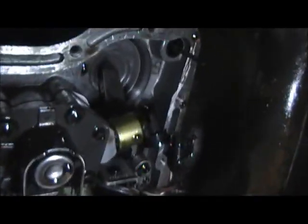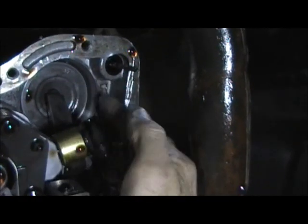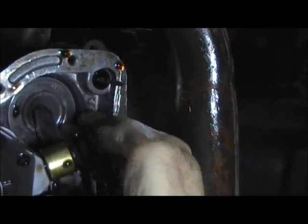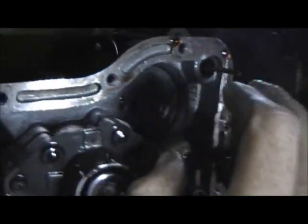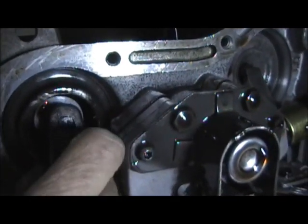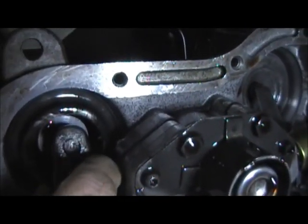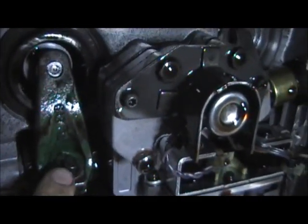The two that you're going to be dealing with is this one here, and you'll also want to check this band while you're in here. Check it for play by pushing on the back or lifting up from the front and seeing how much slack you have in there. You don't want a lot — this one has a lot of slapping there. I'm going to remove that and leave maybe an eighth of an inch. Right now I'm up towards a half an inch, so I'm going to remove a lot of that. You do that by releasing the nut and tensioning it down here.